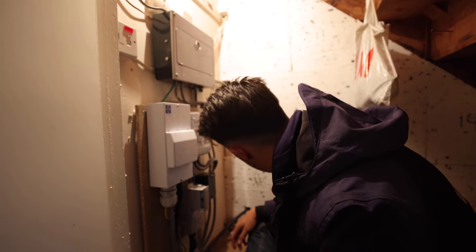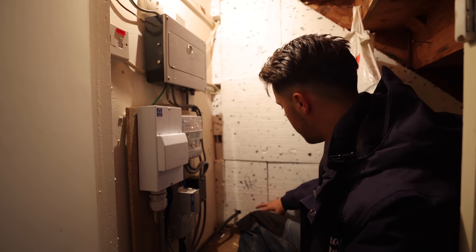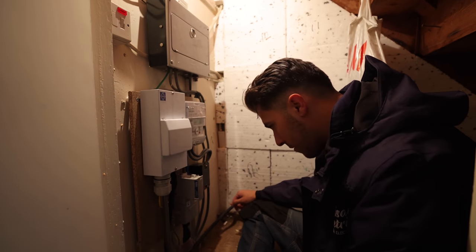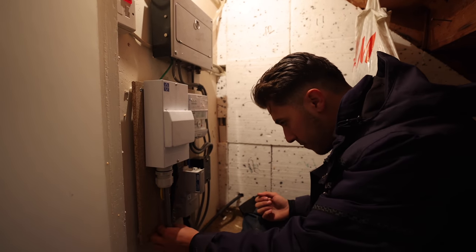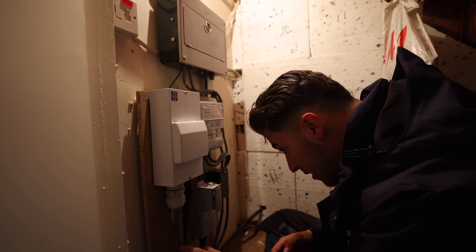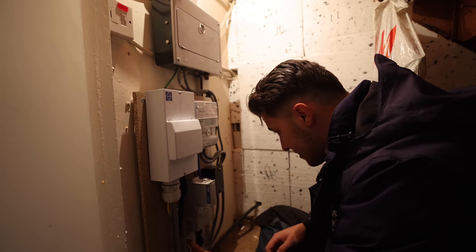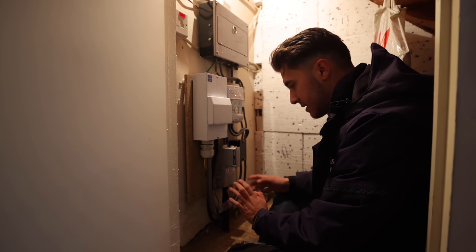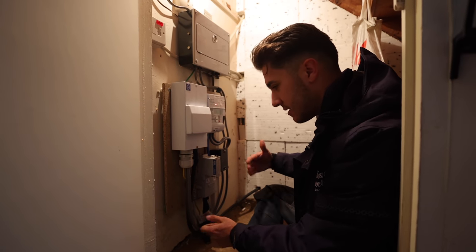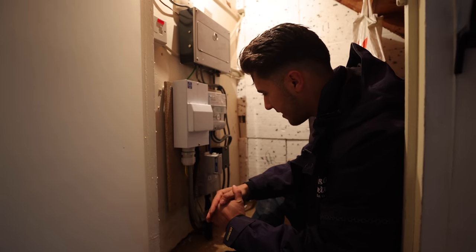You could just drill it straight through really. I'll probably take that little piece of polystyrene out just to make sure I'm not drilling through anything clipped along, and drill out wherever that's come in. So I've checked they've got mains gas bonding. I want to check they've got bonding on anything else that's needed - any other services. There's one for that consumer unit, one for that one, and presumably that one probably goes off to the water - it looks a little bit undersized.